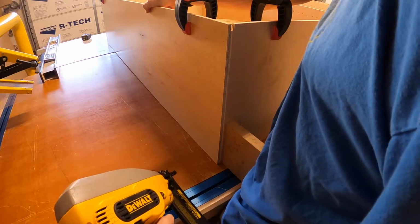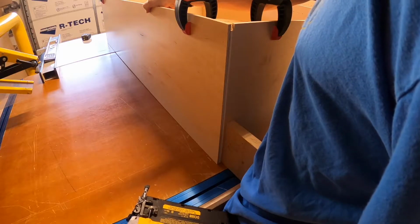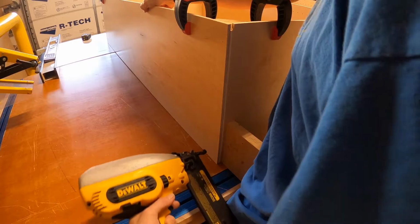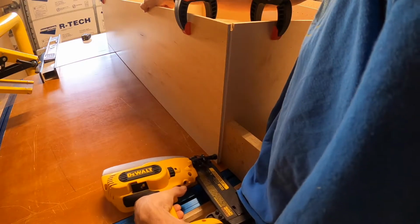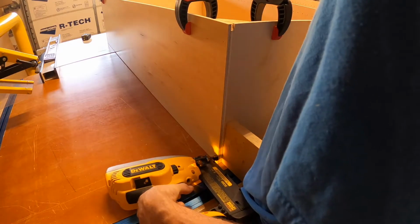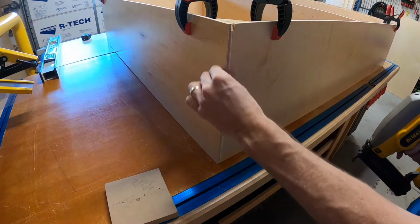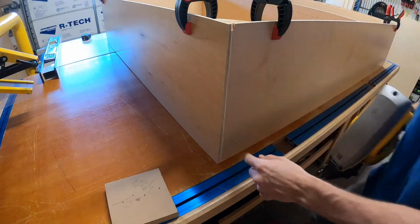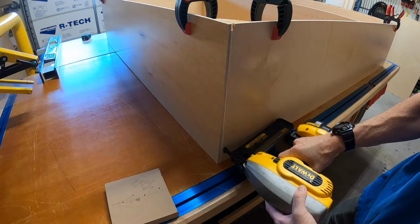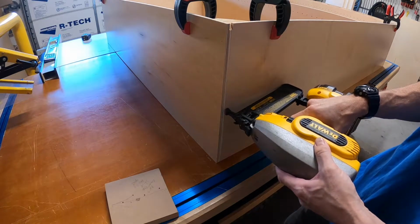And I'm going to hold the cabinet so I can't push it. See how I'm doing that? I'm actually pushing against the cabinet, but I'm also pulling with my arm so I can squeeze it together. And now I'm going to push this one towards the cabinet. So when you do that, everything's getting pushed in. So now it's nice and tight, and the inside of the cabinet's nice and tight. For good measure, go ahead and pin this guy from the top at an angle.